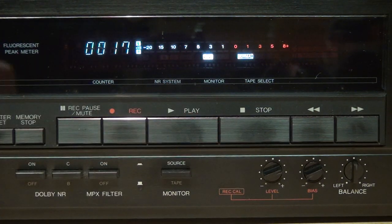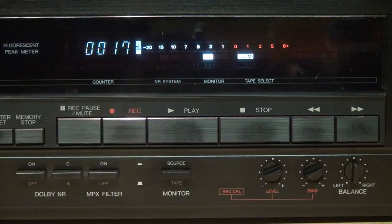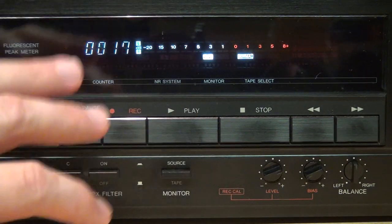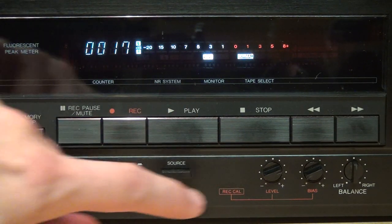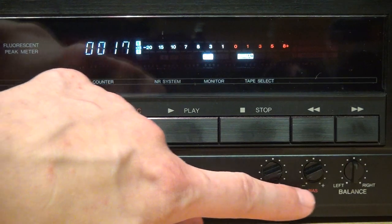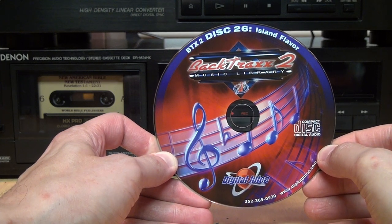So to calibrate this tape, we needed to increase the level and reduce the bias. But it is within the range of adjustment, so it should be a pretty decent tape. If it was a really cheap tape, we wouldn't be able to calibrate it, even with these controls at their maximum settings. And what better song to use to tape over the Bible